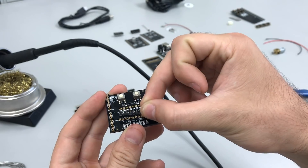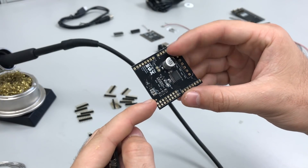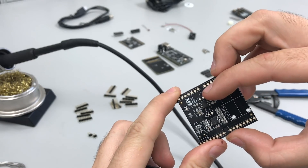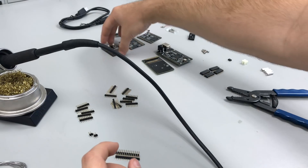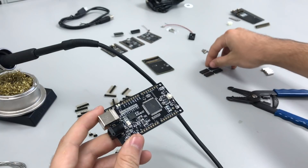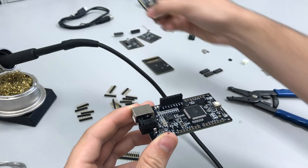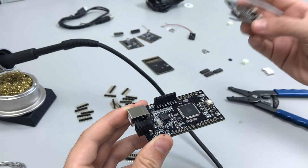The robotics backpack has an extra header for probing the serial communication signals. A couple of the backpacks have 2-pin header locations used for different things. The first thing we're going to do — in line with the assembly guide — is put the female headers onto the Mupad. These will be installed facing upwards so that the backpacks' male headers can plug into them.